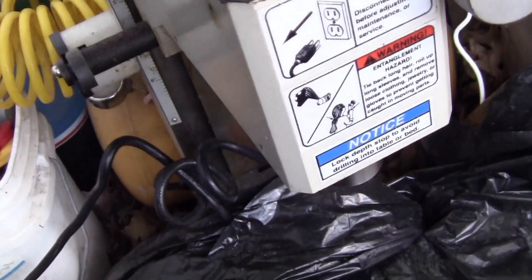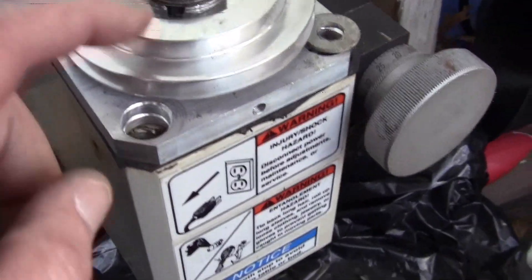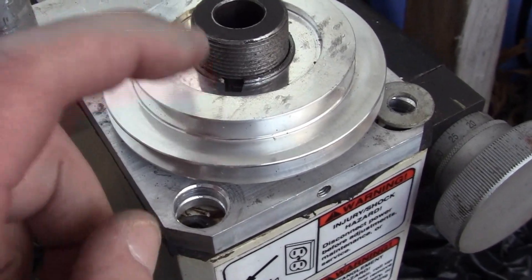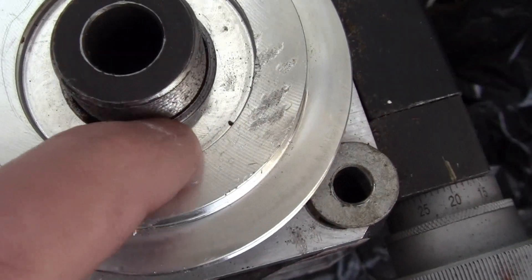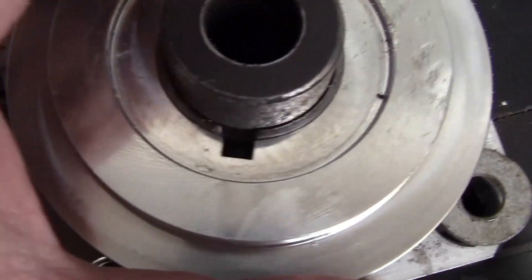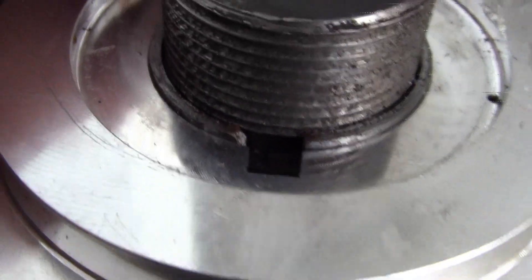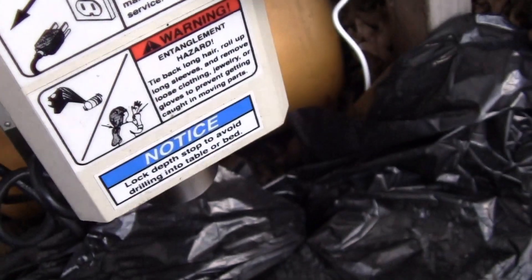With the belt drive, you don't have to worry about shifting into high and low, because this actually has high and low, like a bigger mill would. I didn't have to bore the pulley, but the pulley was 30 millimeters, so I had to go out on the lathe and make a 2 millimeter shim to fit in there and make a keyway in that shim. And that works perfect, beautiful.